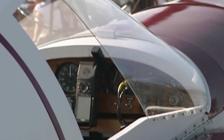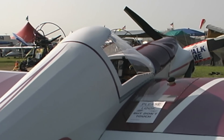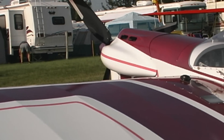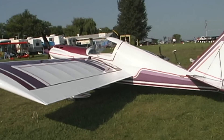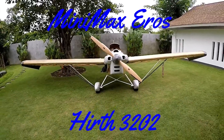When a Team kit comes to you, what kind of special tools or facilities do you need to actually build the airplane kit? There's really no specialty tools. What would help is if you had a table saw, because when you build your front spar, you have to cut a little bit of a taper on top of the spar. But you could have a friend do that on their saw if you didn't have one. Everything else can pretty much be done with a little hand jigsaw and a round sanding disc. All the wood is pre-cut to the right dimensions — you just get the sticks and you have to cut them off at the right angles and sand them to fit.